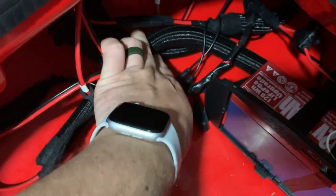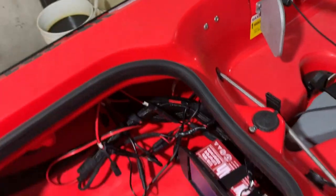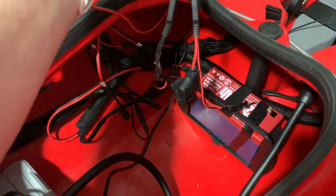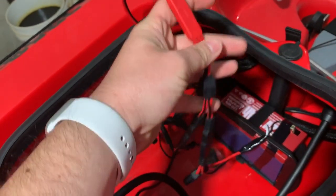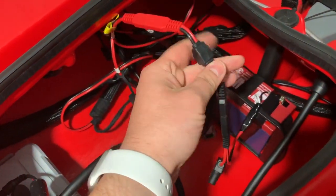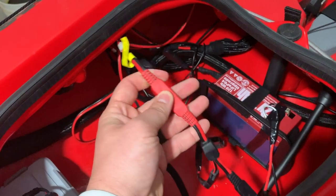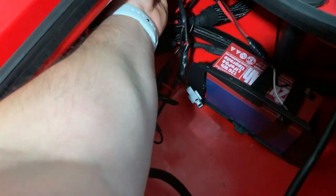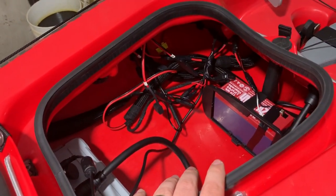Everything running to the back is running through the sleeve stuff to keep it from getting tangled up. The yak power switch box is actually velcroed right here underneath - it's tucked up and out of the way. I just have this Y-splitter run to two separate leads for two separate batteries. It does go from red to black and then from black to red - that's the only issue with that. But it makes no difference; you just have to pay attention to what you're wiring, because the black wire is going into the red lead and the red is going into the black. When they come out it's the same thing - red's going into black and black's going into red, so it's going back to its original line.